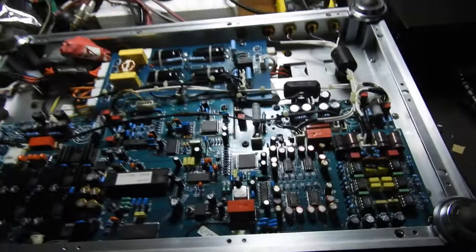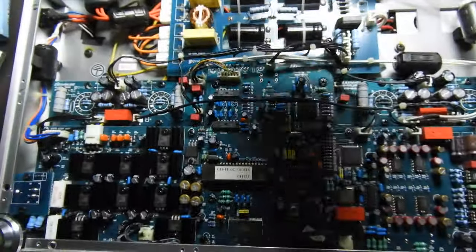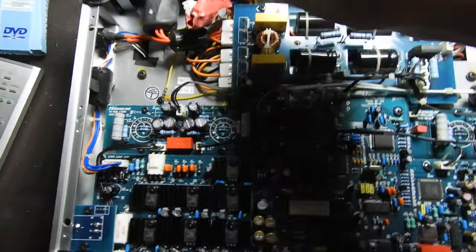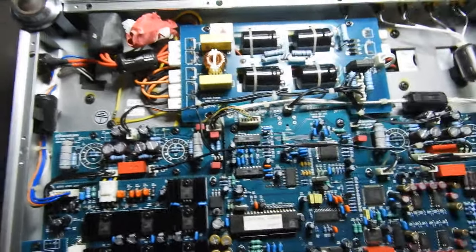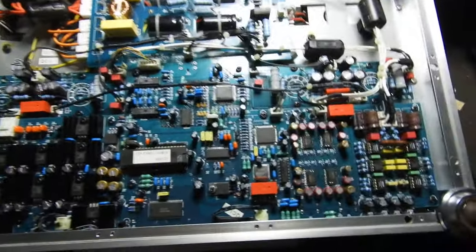Okay, so here it is, a Shanling CD-T100. Here we have a power supply, and to convert it, there are three plugs there, which I presume will go into those spots, with just different primary windings of a transformer. But I'm worried that there might be some resistor changes that I don't know about, and all the rest of it.